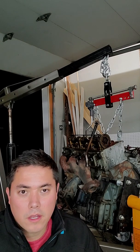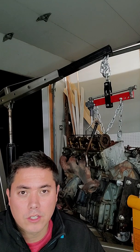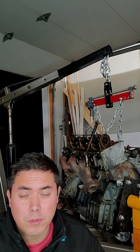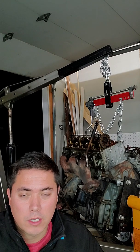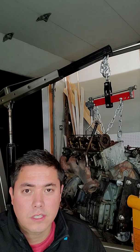There's your fix for the Harbor Freight engine hoist, or any hoist that has a jack or bottle jack. For some reason it was low on hydraulic oil and I just had to remove the plug, add oil, and put the plug back in — and it works great. Like I said before, it was raising about halfway up and then stopping, and any time I put weight on it, it was going down. All you need to do is get a little bottle of hydraulic jack oil and fill her up. The hardest part was putting that little rubber plug back in — using a flathead screwdriver helps tremendously. Thanks for watching, I hope this helped. Make sure you subscribe to the channel, like the video, turn on notifications, and leave me any comments with questions and I will answer them as soon as possible.